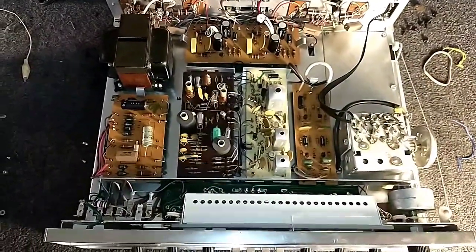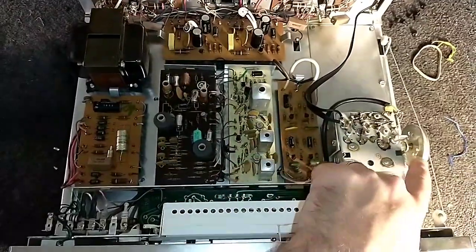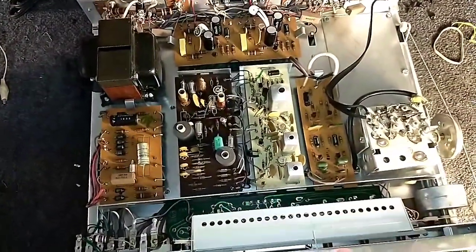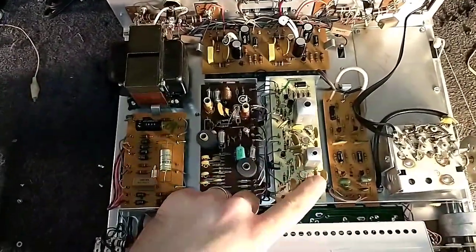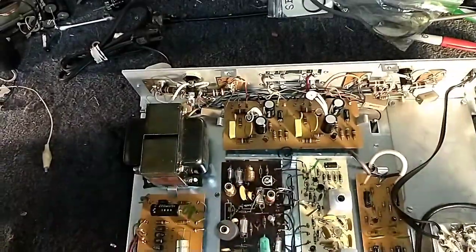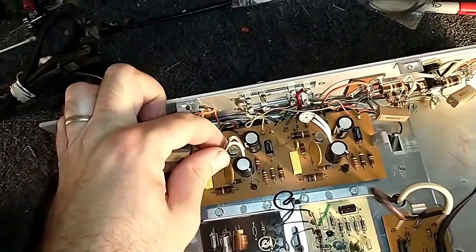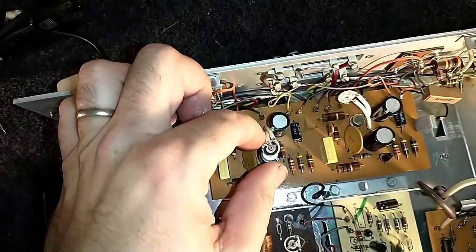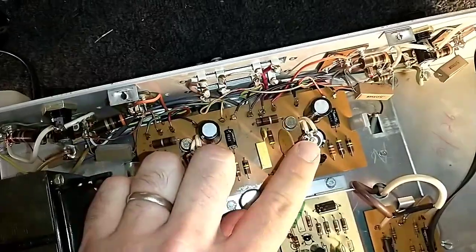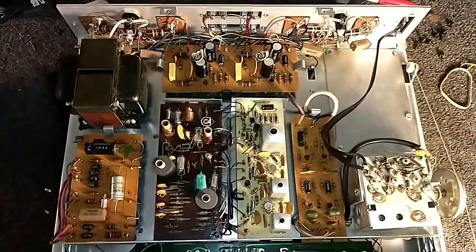Here's the top side - very nice modular construction. Not sure why the tuner is crooked, although it may have something to do with keeping the flywheel on. This looks like your phono preamp, this is your IF, this is your multiplex, this is your primitive regulated power supply, and then this is your amplifier. Now what's interesting here are these bias pots which I think somebody may have replaced. These look like they're broken - it's really weird that somebody would place these in here without adjustable wipers, although the wipers are in different positions based on looking at the two.